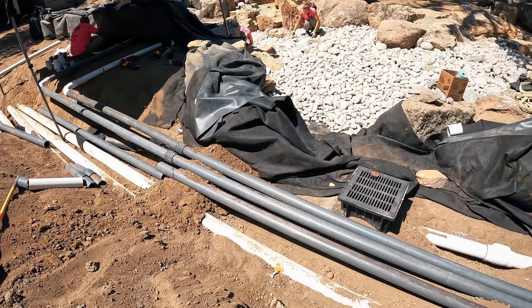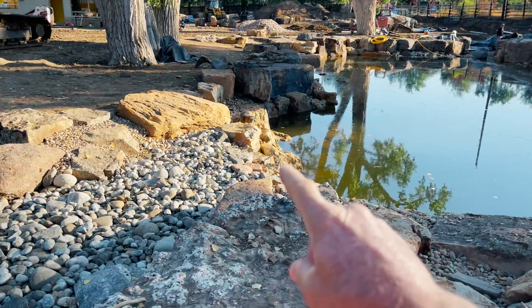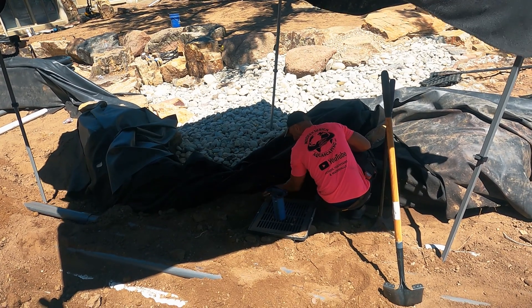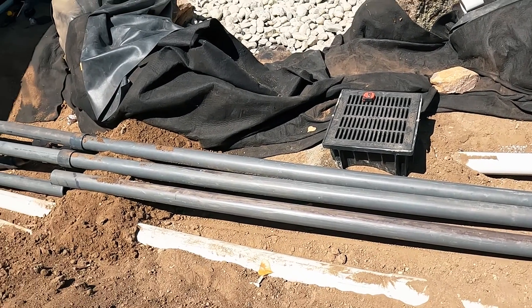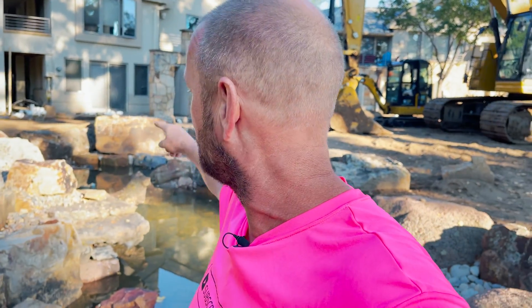Some key factors on this overflow that I'm going to point out right off the beginning: the intake bay from the pond comes in here. Water flow sweeps nicely around and it goes this way into the back. All your suction lines for your pumps are back here on the backside. The reason I chose to put the drain in the location that we chose is because of leaf matter. A lot of times the floating garbage in a large-scale water feature covers the drain and then it does not work — obviously creates a problem. So I thought in this water flow, if we tuck the drain off to the side outside of the actual flow of water, debris won't be so encouraged to go into it. The majority of the debris is going to follow the current back into the back where the major suction is.